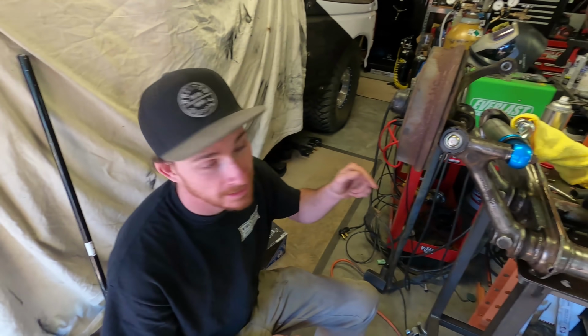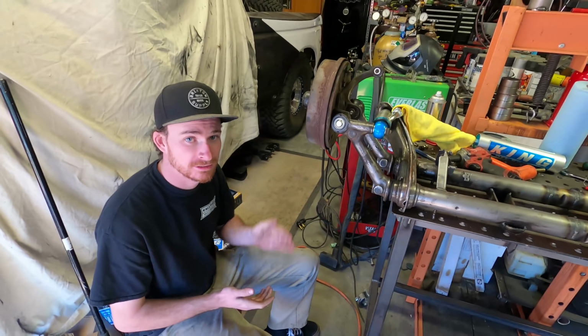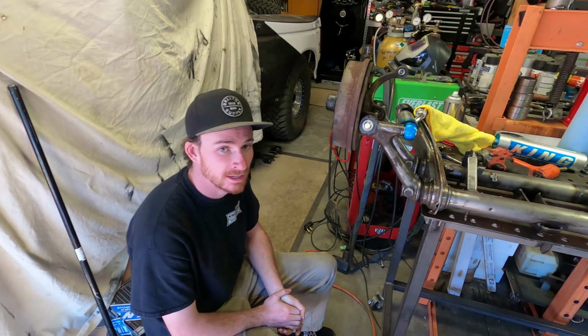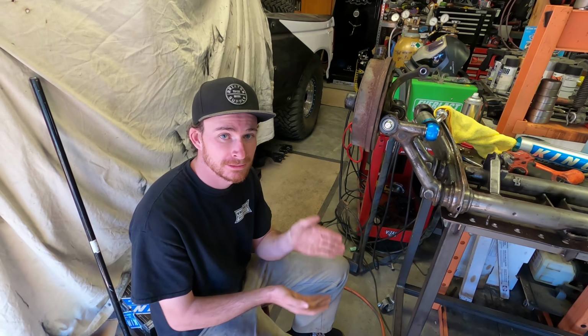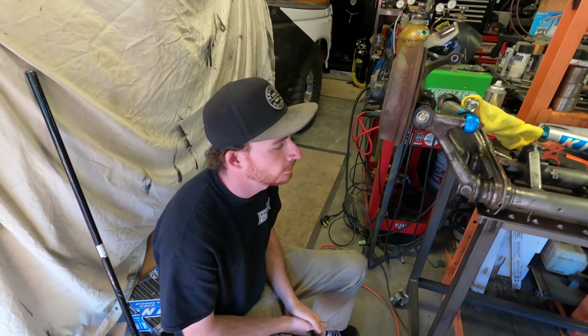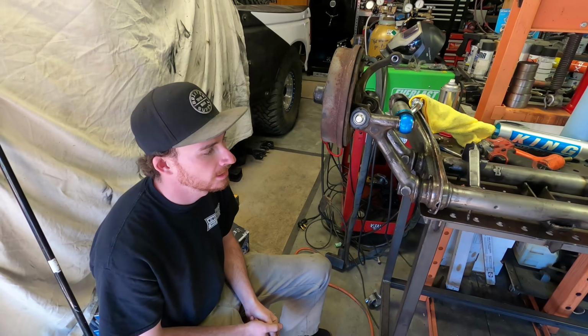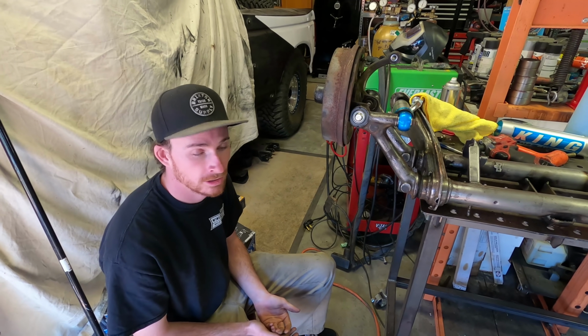And why is that, really? Mr. Christian? Because you're going to screw things up. Well, what are you going to mess up? Go through it. The reason you don't want to do that is because there's an IFP inside of the reservoir that separates the nitrogen from the oil. If you don't run it with nitrogen inside of there, it's going to move that IFP because it needs to be set at a certain depth. So if you run it without it and you start cycling the shock a whole bunch of times while it's on the vehicle and you're driving, it's just going to screw that up and then the shock isn't going to work properly.